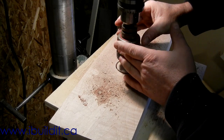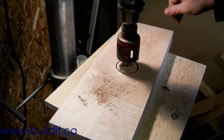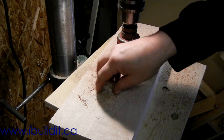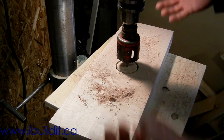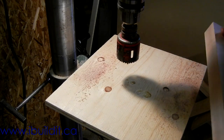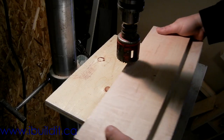You might notice that I'm going a little fast and I keep plunging in and pulling out. The purpose for that is you can go slower, but what happens is these chips gum up the teeth too quickly. Going faster actually slings the chips out better. So that's been my experience anyway — your experience might be different.